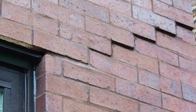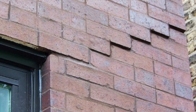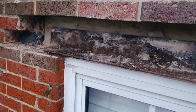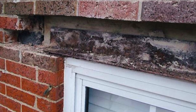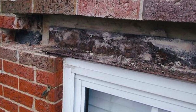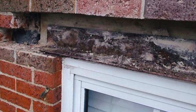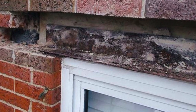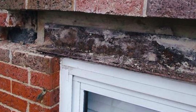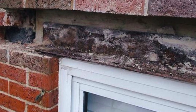Here's another picture of a typical rusted lintel and what it can do to the side of a brick wall. In this picture, you can see a rusted lintel that has heaved the bricks out, and the brick layer has come back to repair that area — taken all the bricks out to expose the rusted lintel. They will have to take that lintel out, put a new one in and then new bricks, which is very costly, and completely avoidable by coating that lintel in Tough Skin Clear rubber skin.